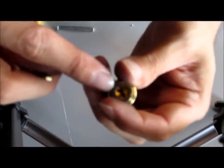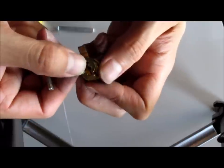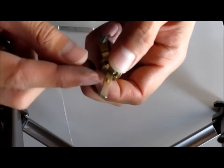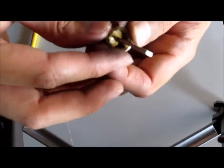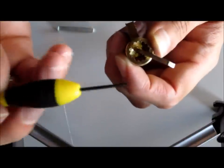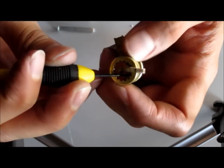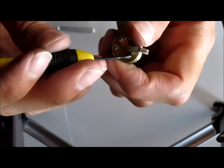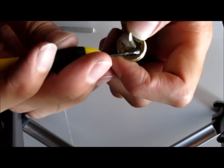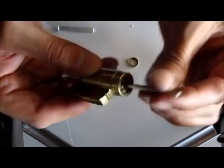What you're going to do is line up that washer — it has an open space on it. You're going to line that open space up to where the little spring is, then put the back part of the deadbolt in, and then put this over that. Grab whatever you're using to press the spring-load down a little bit, and then slowly screw it back in. It's going to be kind of tricky — but there you go, got it in, and just keep screwing it down. That part is back in.